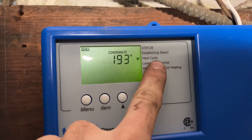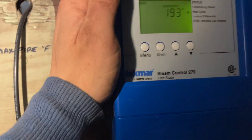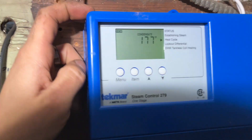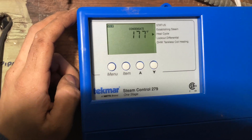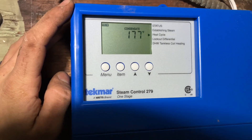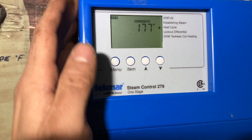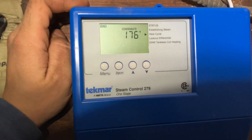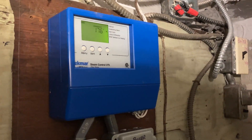Our little Power Flame burner symbol went off, but we're still in our heat cycle, which means this is now the cool-down period for our boiler. We can flip the bypass and our boiler will run, but I want to go and change a couple of the settings. I went all the way up to the top floor and the radiators are warm but not super hot, so I want to make sure that as long as those are heating up, everything else underneath will be heating up as well. The max pipe temperature we got up to is 203°F, so I'm going to make a couple of adjustments on our establishing steam temperature — maybe on our room temperature too — so it'll run a little bit longer. That's how we set up a Tekmar and a summer/winter switch for that Tekmar.